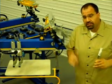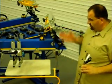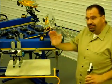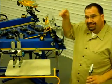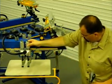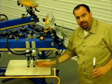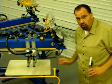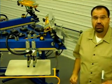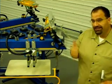And that assures us that this arm, as it comes from head to head, all the way around the machine, is in center, that the arms are in center to each other. So the relationship between this linear movement and the pallet and the head are all running true to each other. What we'll do next is we'll show you how to do a center line of your pallet.